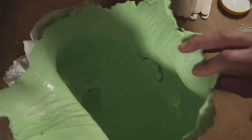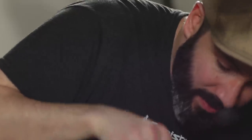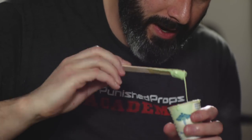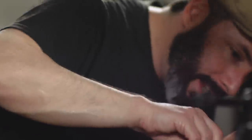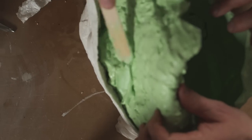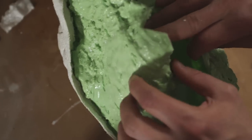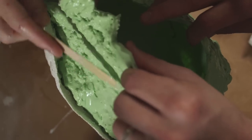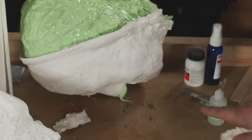I'm also going to use some of this to plug up the nose — it doesn't matter if the nose is pretty, we just don't want liquid to come out when we're casting stuff into it. So we're just going to jam a bunch of silicone in there and plug it right up. Apply it to the outside so you're not messing up the features on the inside.